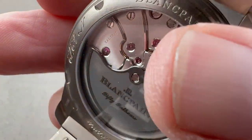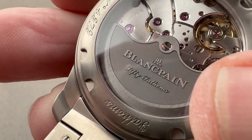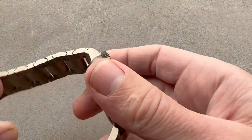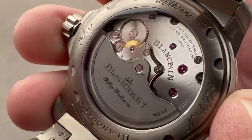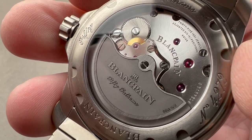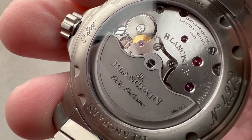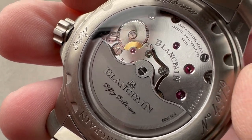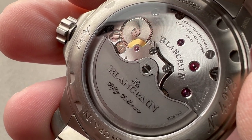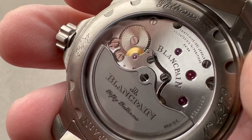We have an 18-karat gold rotor that is mirror beveled on its edge, satinated in a channel around the media-blasted center, with grooved snailing on its outer face — four finishes on the rotor alone. Three barrels ensure a very even and flat release of torque, so when the watch is freshly wound it's not going to gallop and gain a lot of time, and after 24, 48, or 72 hours it's still not going to be losing amplitude, because these three barrels in series have staggered and phased mainsprings to keep the torque curve flat and the timekeeping regular.